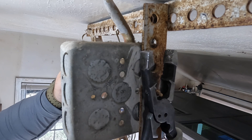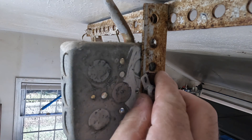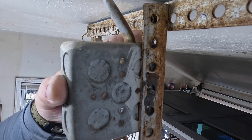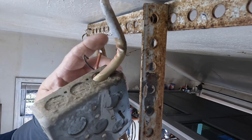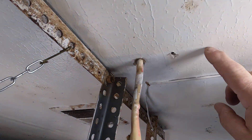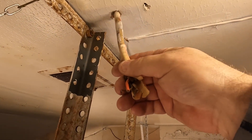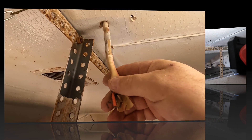Do we get that on tape? So what I'm gonna do — I'm just gonna cut in an old work box right here, put this right into the old work box, connect the new receptacle to it. Boom, done, clean.